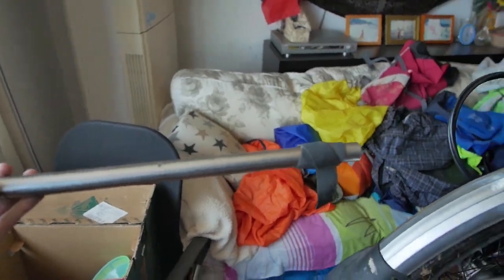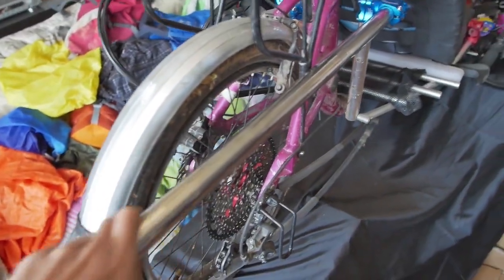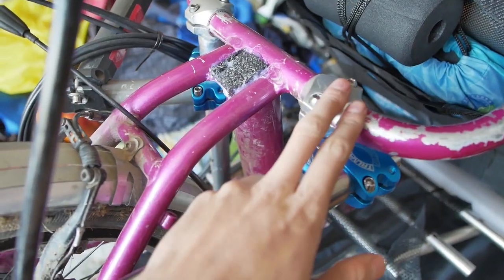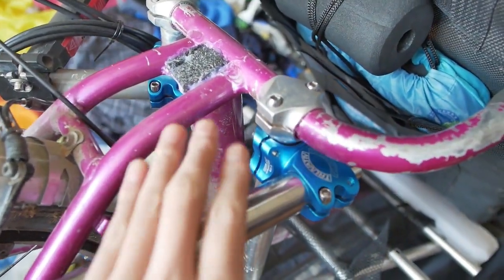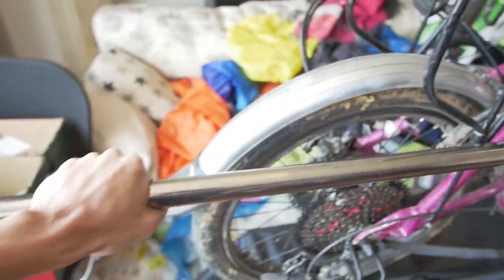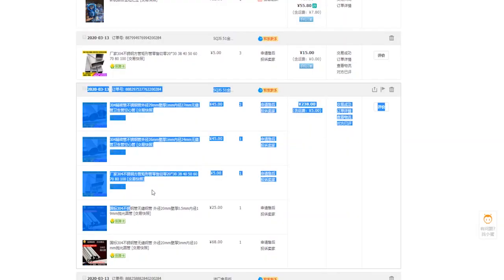And on the other side, I will put the same tube like this side, and so the trailer tongue, or I call it the connection, connects to a ball bearing with these two tubes over here. And all the pushing and dragging force will apply to both sides of this elongated stem tube here. And it's quite close to the main frame tube, which is thick and strong, which takes all the forces. So that creates a fairly reasonable, stable connection. Well, you see a square tube connecting from here to here and being mounted on the screw hole here as the reinforcement.